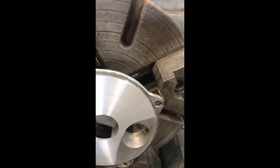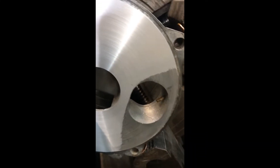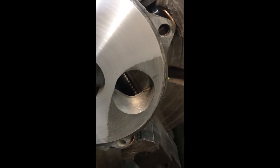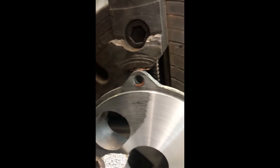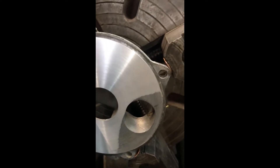I just finished the first cut — I took five thousandths off after I touched. You can see this is why, or how, you know you got a pretty good indicating job. See how both of them have your low spots in the same place? This is normal for the way these rotary valves wear. People think nothing is wrong with their jet ski, but most of these are bad. It'll still run though. I'm going to cut some more.